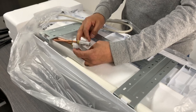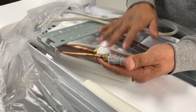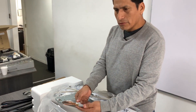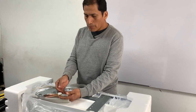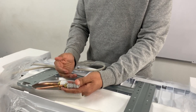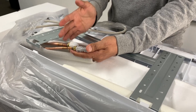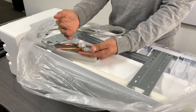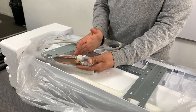A very important tip: the interior unit comes with some tapes, as shown internally. The manufacturer sends it pressurized with nitrogen. Why pressurized? So that the unit has a guarantee that it is hermetically tested — meaning it has passed a quality control pressurization test and has proven that it does not have leaks. A sample of that is when we remove these pipes.